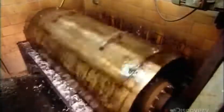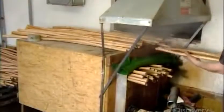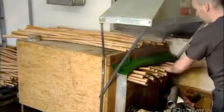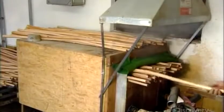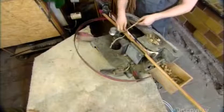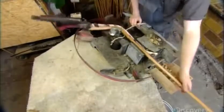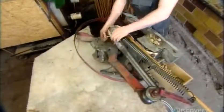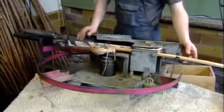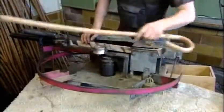After a few minutes of tossing about, the sticks come out squeaky clean and they're ready for the steamer. The sticks are steamed for 20 minutes, which makes them soft enough to bend. A worker then secures the stick and activates a spring-loaded arm that wraps one end around a form to curl it into a crook. He ties it so it holds the crook shape and retracts the bending arm. This crook will serve as the walking stick's handle.